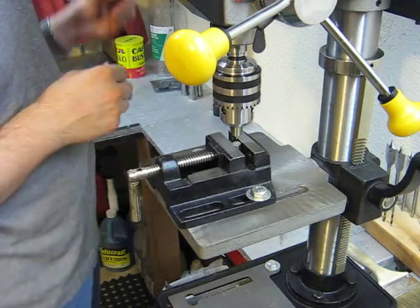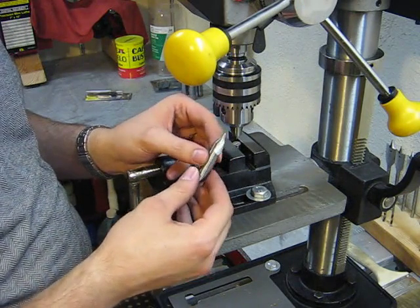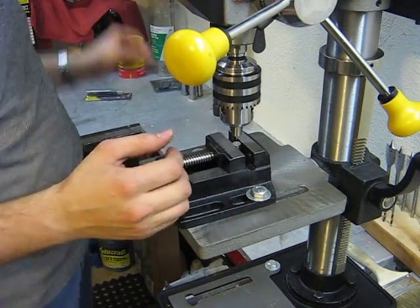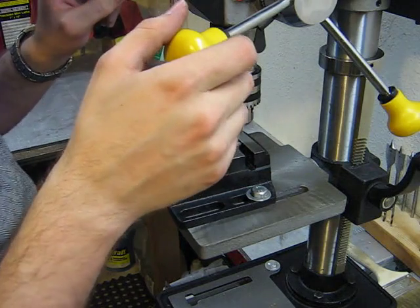The best kind of drill used for this is called a center drill. You can pick these up at Harbor Freight for a couple bucks, but you can use a regular drill bit — that works too. And we don't have to go very deep at all, just enough to make a divot for our center punch to fit into.